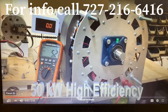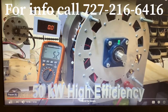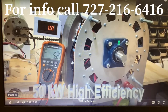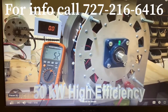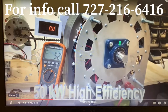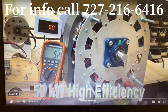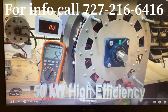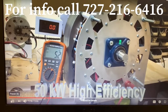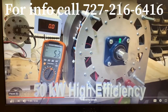We normally rate these at about 250 amps. So if you're running 250 amps, you're running about 200 volts — you're getting 50 kilowatts. Now the amount of current is dependent on the load you have. You can't get current without some sort of load.